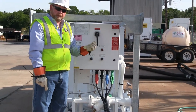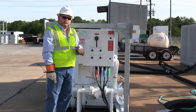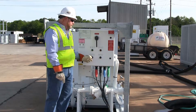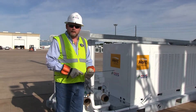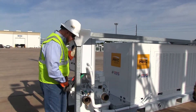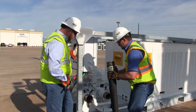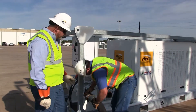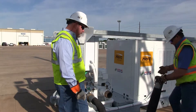While we're hooking up the water and filling the system, the chiller can continue to warm so the compressors are started properly. Please note that anytime the power is disconnected from the generator or house, or if someone turns the system switch off, that resets the one-hour lockout timer. The next step is to hook up our main water lines — the inlet and outlet — accomplished by these four inch Dixon QC connections. The female is directional flow, so we'll have a male hose going to the female, and the male coming off the chiller will be our supply. Make sure the gasket is good, lock down both lock rings, and ensure the hose is not in a bind or under any stress.